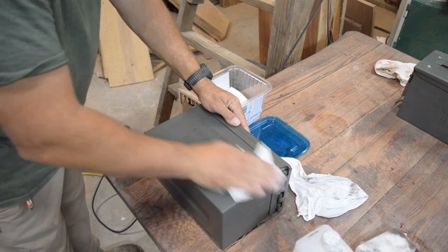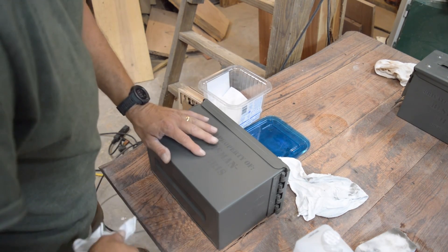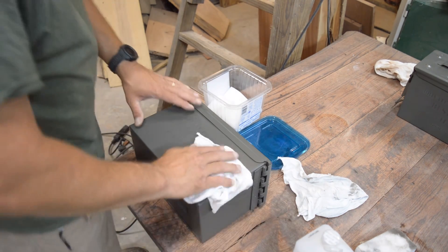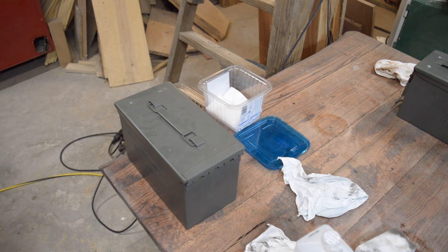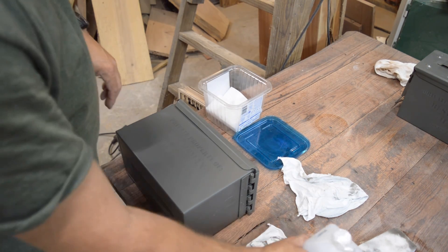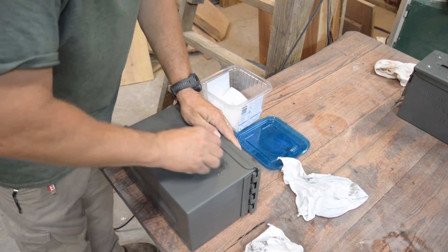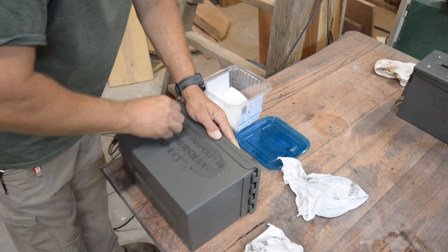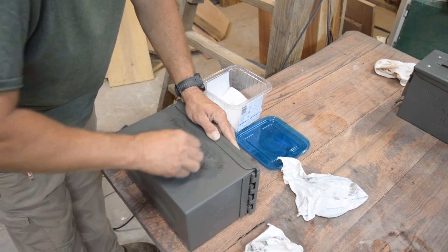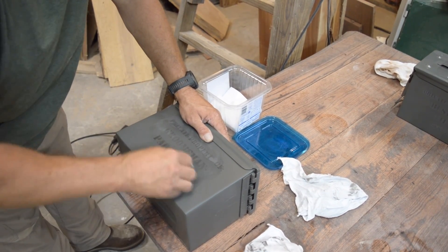This is not stainless, so the engrave is not going to pop and shine as much. It stays relatively tame but does add a little color to it. It's noticeable especially when you get off at an angle - there's just a little bit of discoloration in the metal. I ran one over there four times trying to get it to be shiny like my tumblers and it's just not happening. This grade of steel is obviously not going to shine up as much as tumblers do.